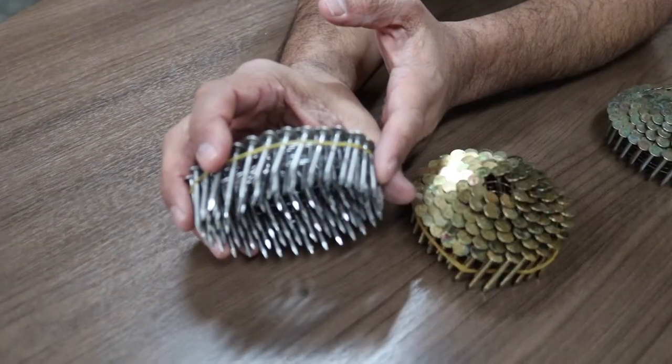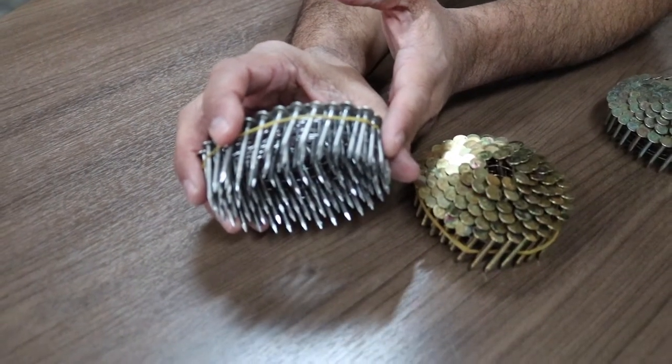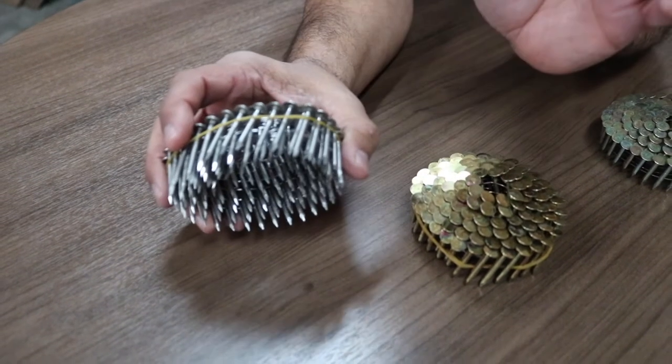Another very common thing that we use is when we're roofing on low pitches, we love to use non-corrosive nails. These are made out of stainless steel - a lot more expensive, but definitely worth it. When the water is rushing over your roof, especially on low pitches like on back porches, we see the water go underneath the shingles and rust nail heads out.